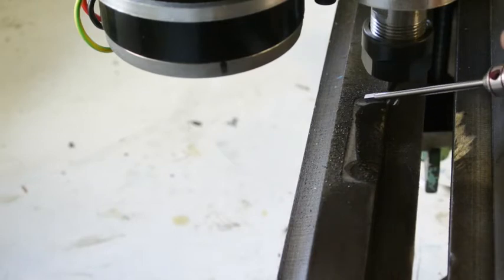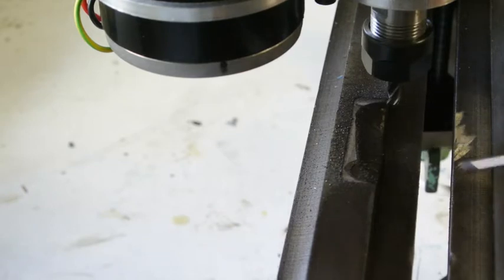You can see where I've machined so far — just one pass to make sure everything was set up correctly. And I'll machine that down probably about eight millimetres or so, and then I'll make up a piece of cast iron to fit this base and glue it in with JB Weld, and then machine it using the same arrangement as I've got now. That should work fine as a repair and look a lot better than it does now.